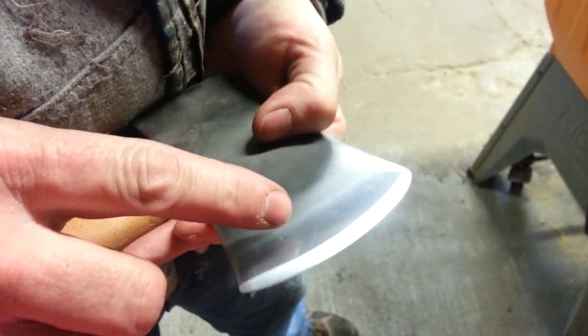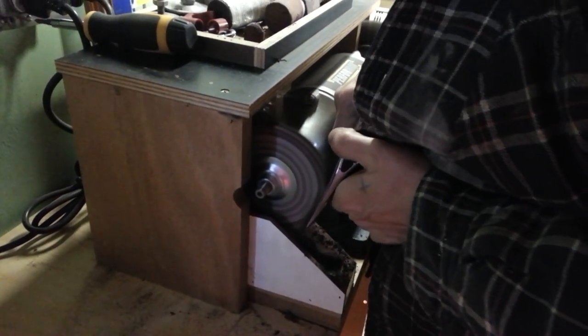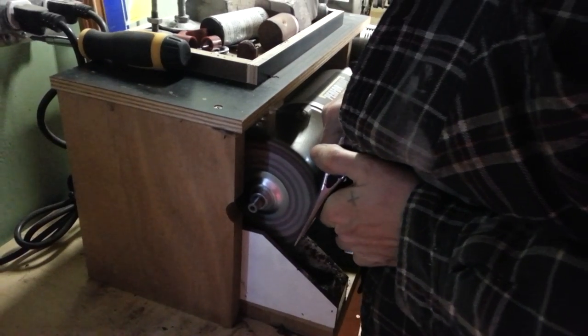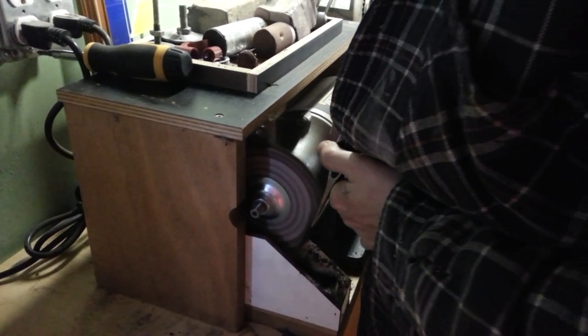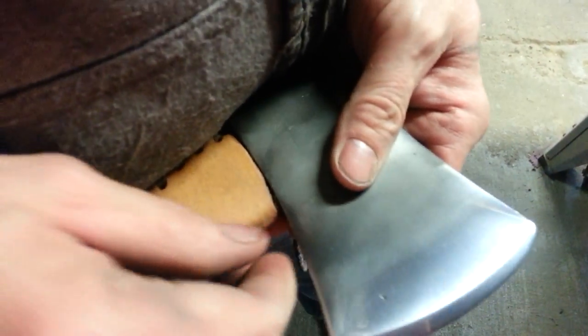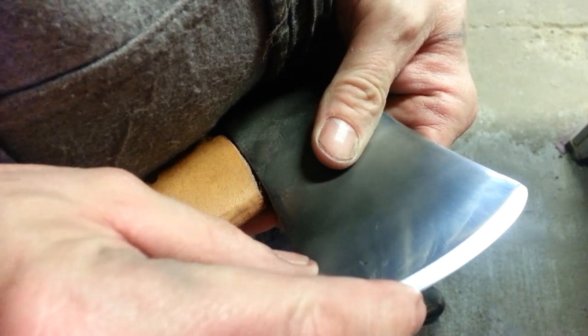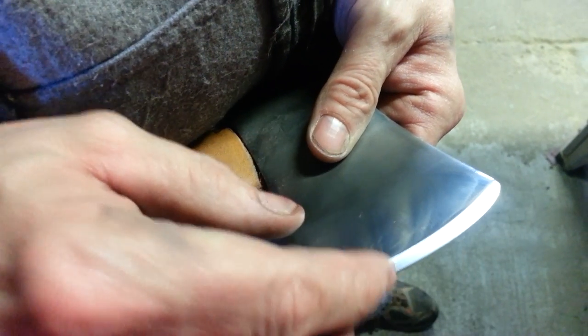You can see here how it's kind of dull looking. The edge has really improved a lot, so I'm going to keep working this for just a bit. You can see how the scratch pattern is really a lot more consistent. That already has a really nice edge. But I'm going to do the back side too, because on a single bevel tool, what gives it its edge is how flat this back is — and that's what brings the burr straight up.